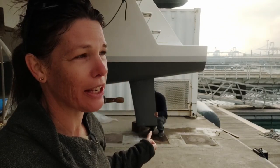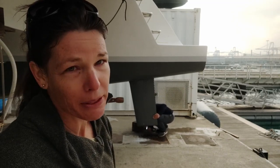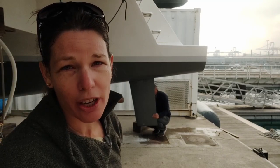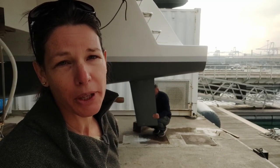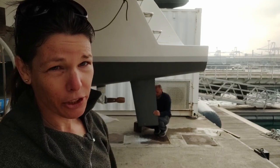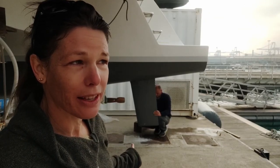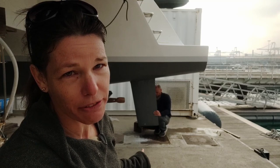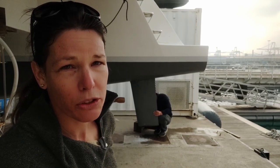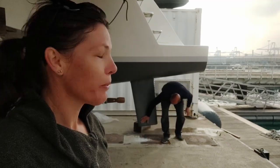You can see Shane is actually drilling holes in our brand new rudders. The reason he's doing that is he's prepping the rudders ready for some winglets that we're going to put on. Unfortunately we're not going to have time to put them on before we go in the water tomorrow, so we're just pre-drilling the holes. What he's drilling into is a solid glass plate — we're not drilling into the foam. Kent, when he made the rudders, made it with a solid piece of plate in the bottom so we could put some big screws in and attach our winglets.